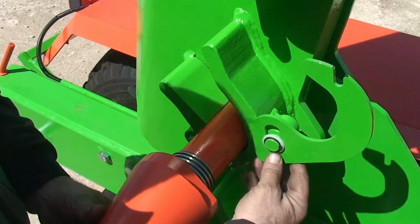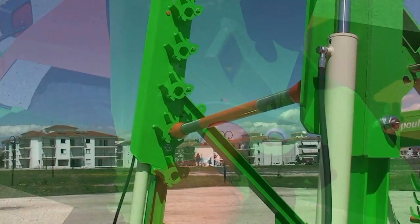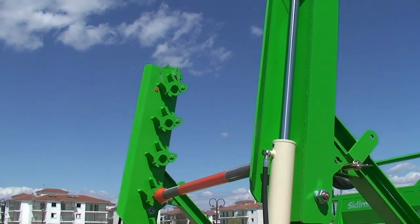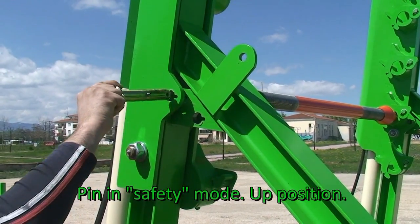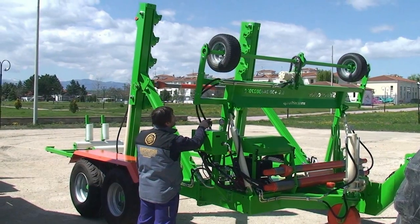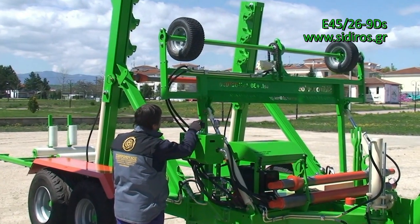Shafts can be safely locked on the rail trailer during reeling. Six wrenches are used in order to screw the conical nuts of the four shafts. Using the hydraulic controller stick, it is possible to bring the moving wheels close to the rail.